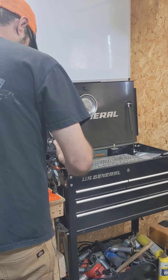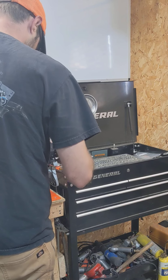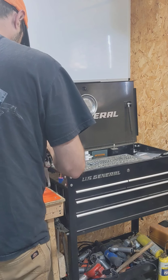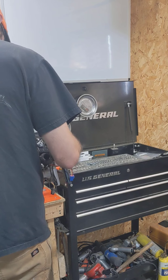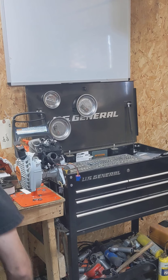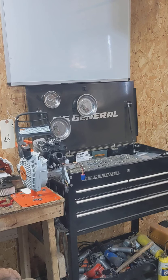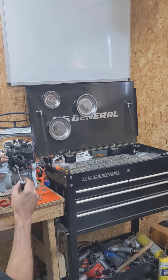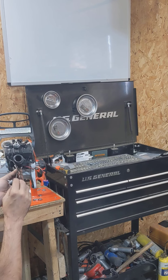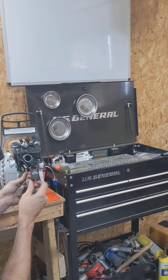We'll get this handle out of here. And right here's your injector. You do got one ground wire you got to pull off your injector — it's got to stay on the saw. So you just pull this left bolt here, and that is all you have to take off of it. Turn it back in so you don't lose it — it's kind of a special little guy.